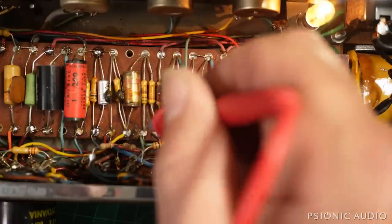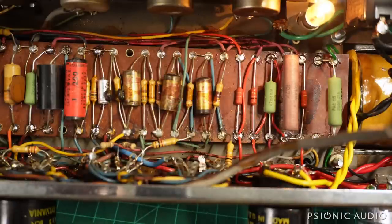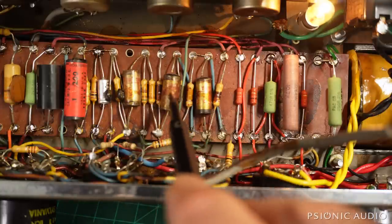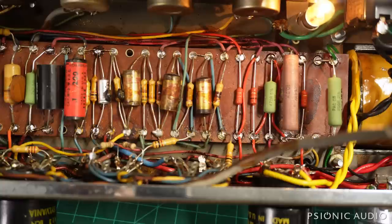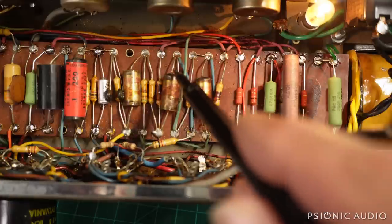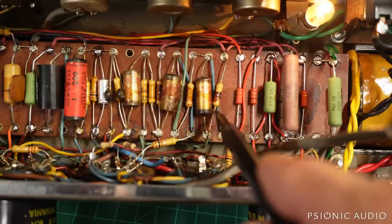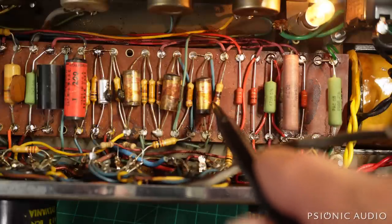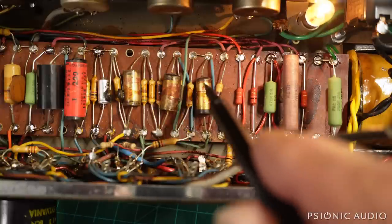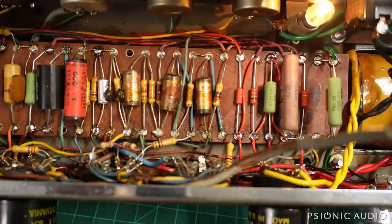At this grid — about 30 millivolts. That's way too much. At the other one, about 70 millivolts. That's why I checked this. I have no guarantee that these two capacitors are not leaking, and then the grid leaks on their outputs might not be great. One of them looks kind of suspect — I noticed before but couldn't tell if it was just bled paint or discoloration. I'm going to do some more research, but I don't want even 30 to 70 millivolts on the grids of these tubes.